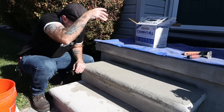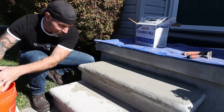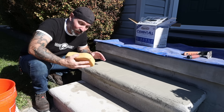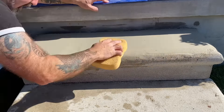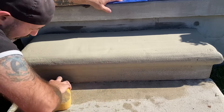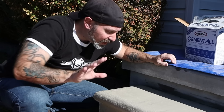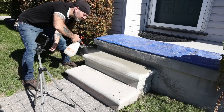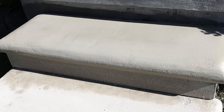Now I've let this set up long enough. I don't want to let it set for too long because this will harden up and not be very workable in probably the next five minutes. Now this is the point where Cement All becomes very forgiving — we can just take a damp sponge and blend everything in and get rid of any of those inconsistencies. The only thing we have left to do now is water cure this for one hour. That's going to keep this repair from getting dehydrated and forming surface cracks.